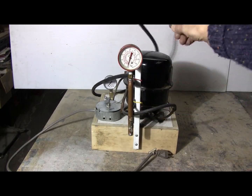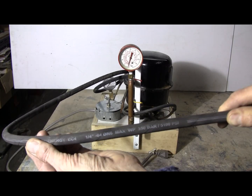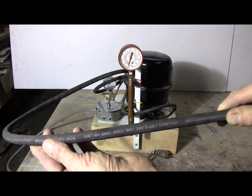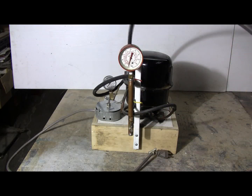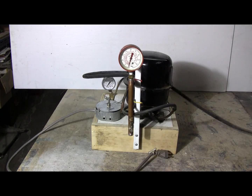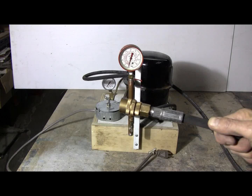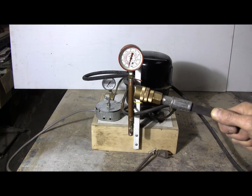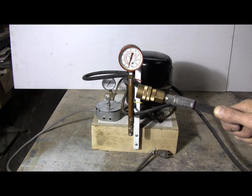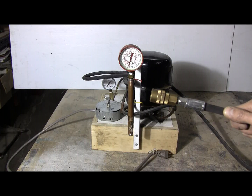The black hose here is a hydraulic hose. It's quarter-inch and it can take a maximum pressure of 350 bar — 5,100 psi — so this hose is not going to let go. You can get one from a hydraulic supplier. For the kind of pressure from these compressors, you don't want to use anything less than a high-rated hydraulic hose. The connector on the end is a standard type-M shop air coupler. These are only usually rated to 300 psi, but this particular one seems to be good quality and it's withstood the few times I've gone up to 750 psi with no problems, no hissing, no leaks.